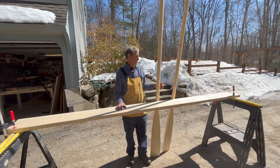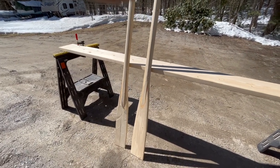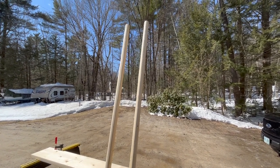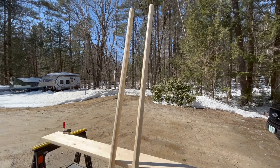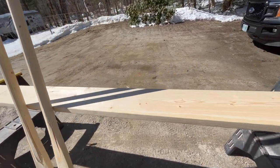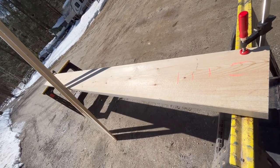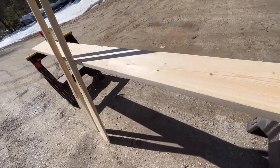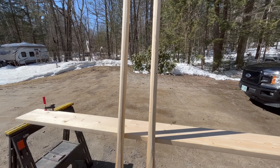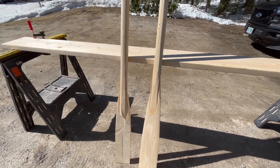I have these blanks — I started them out last fall, so this is where I'm starting off with my oars today. I've also run some of this through the table saw to get some of the edges off and cut them up into an octagon shape. They are fairly clear stock and they came out of some 2x10s. At my local lumberyard I can buy 2x10s that are fairly clear if I pick them out. These are starting out as being 2 inches round, so I glued up some pieces onto the edges of them using Total Boat epoxy.